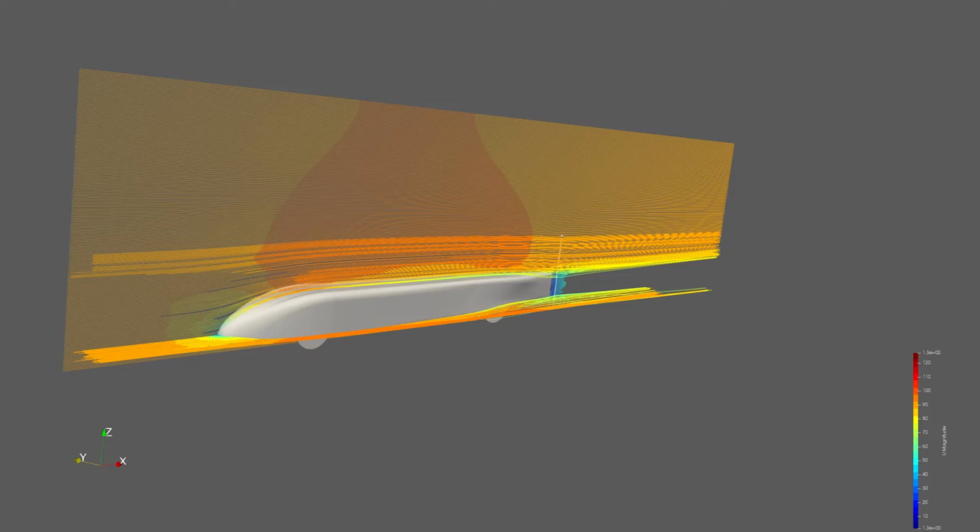I was also able to get the nose to be a much better elliptical shape. And this allowed, again, the air to flow nicer around the chassis itself, as well as, because it's so nice and rounded, again, it helped to keep that center of pressure moved further back.